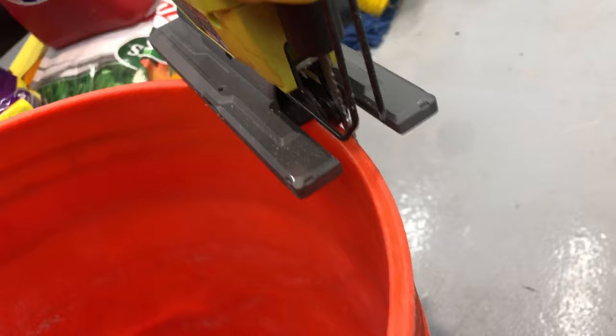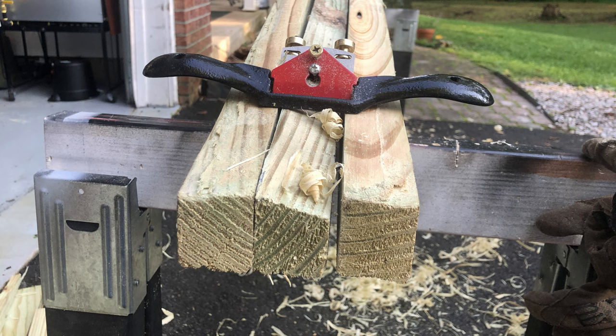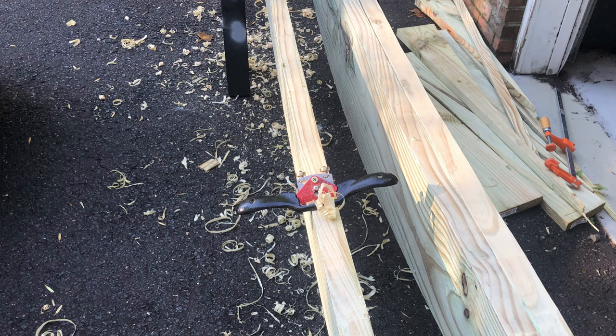If you're using a jigsaw like I did, it tends to leave an uneven edge because as you cut, the blade bends. So if you line up all the stringers clamped together, you'll notice that it's not really flush with each other. I use something called a spokeshave to do the best I can to match the profile, but it's just not going to be exact. However, I thought this to be a better option than sanding wet wood — I don't even know if that's possible. It is pressure treated, which you really don't want to be sanding because of all the chemicals. If you can, you can also use a planer.